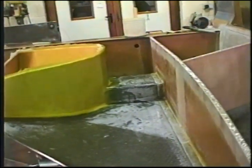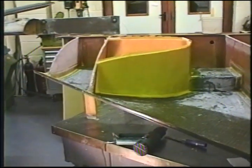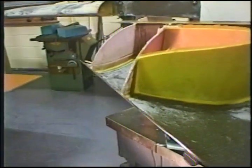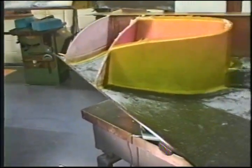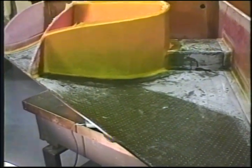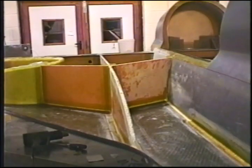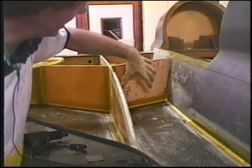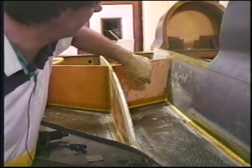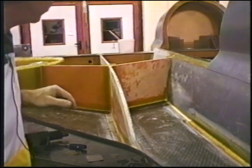Two plies. And we did it as two separate pieces and let the lap occur in the back. You can see the lap right there. You lap one inch onto the bulkhead up front, and one lap at the back, at the bottom, all the way around. And the ribs are in place. We didn't put a tape in here because we're going to cut that away tomorrow and expose that end. But tomorrow we're going to do the T-tapes.